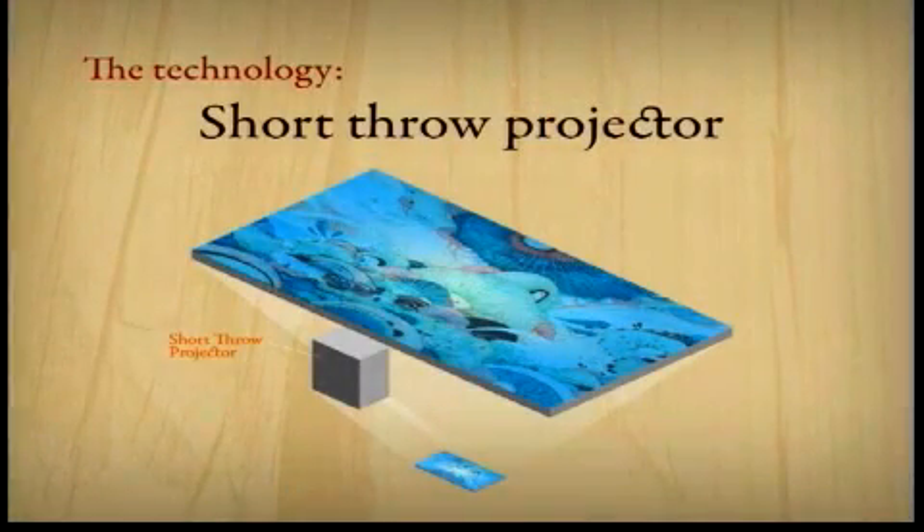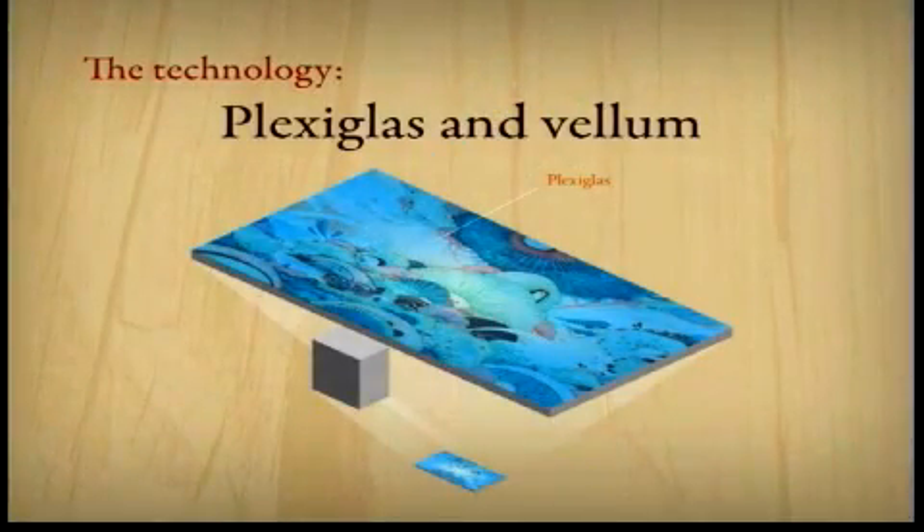So how does this thing work? We've got a projector and we shine it onto a surface. Projectors need about six feet to get focus, but we wanted our table to be usable in a smaller space. So we use a mirror and bounce the image off it, which basically cuts the throw distance. That all shines up to a piece of plexiglass. By itself the image would shoot straight through and wind up on the ceiling, so we put a piece of diffusion material over the top — cheap, that was the whole idea.